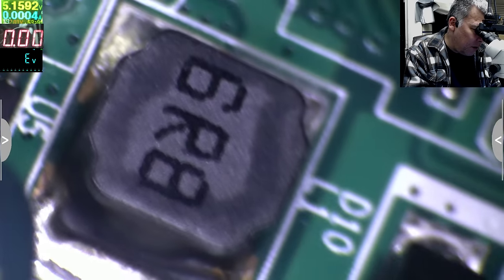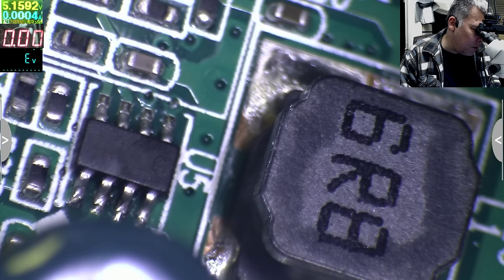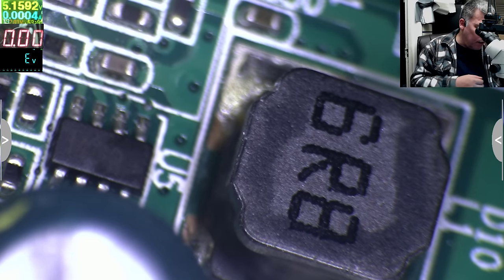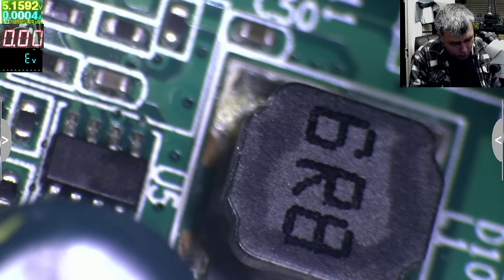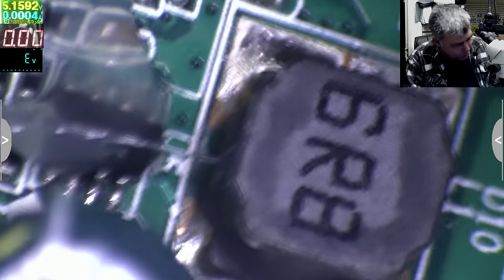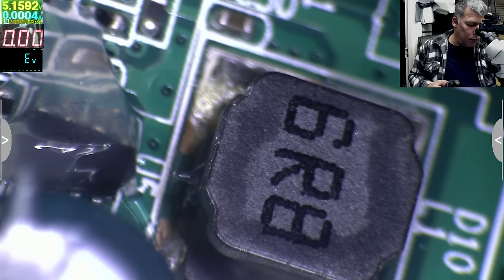So what's going on here? Which is shorted? The diode? The chip? Another thing from the 12 volts power rail? I don't know. But you know what I'll do? Probably the chip is gone. Looks like it's exploded. I'll take out the chip and I'll check again, yeah? Or I could take out the coil, but it's easier to take out the chip.